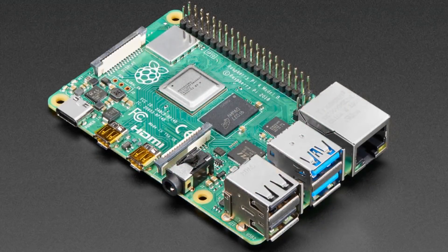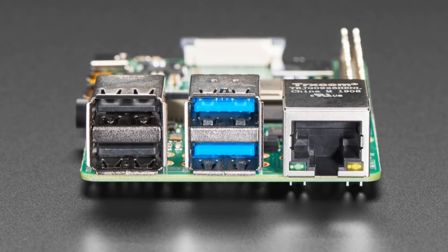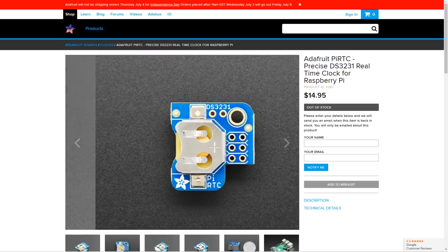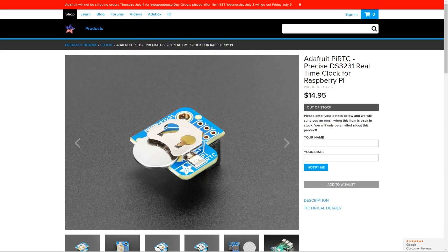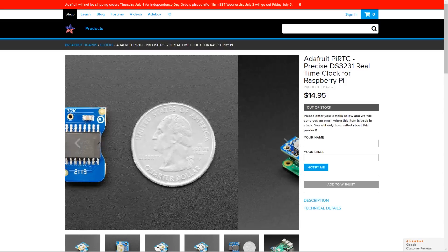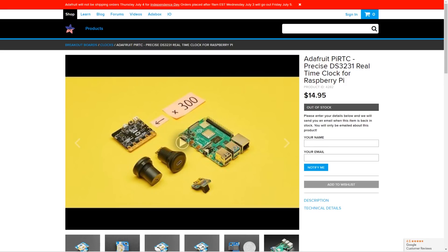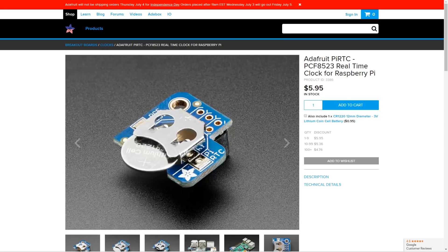For this week's product spotlight, you probably know by now that there's a new Raspberry Pi 4 out in the world. The best way to get one from Adafruit is to sign up for notifications for when stock becomes available. But one feature the Raspberry Pi still doesn't have is a real-time clock chip that can allow it to track time accurately even when the power is off. For Raspberry Pi projects that do data logging or work as clocks, alarms, or servers, you'll want to pick up an Adafruit Pi RTC. This small add-on mounts directly on any Raspberry Pi's GPIO pins — no soldering. You just add your own coin cell battery and you've got a dedicated real-time clock that will keep time for five years or more. The Pi RTC comes in two flavors: the best and most recent is the precise DS3231 at $15, which uses an extremely accurate chip. For less critical applications, there's an older PCF8523 version that sells for just $6. You can find links for both and for the Raspberry Pi 4 down in the description.